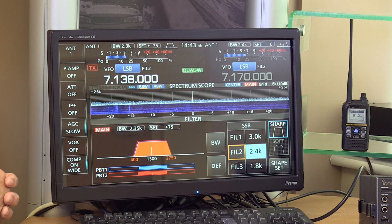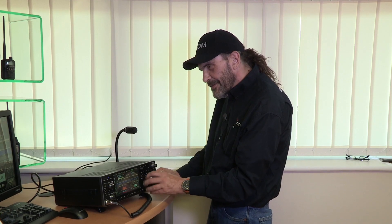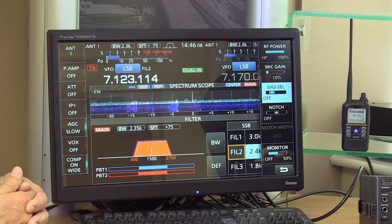The filters have sharp and soft settings — you'd normally use sharp for CW and soft for SSB for a nicer sounding result. Digi-Sel is a very high-Q preselector placed in front of the receiver to protect it from strong out-of-band signals. Switching Digi-Sel on and off with a strong signal present shows quite a marked effect on adjacent channel splatter — a real advantage on contest days when the band is full of strong stations.